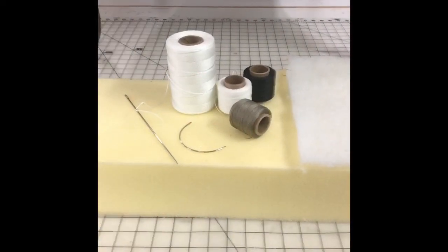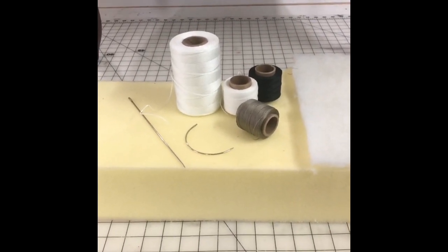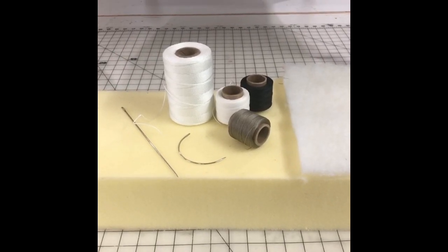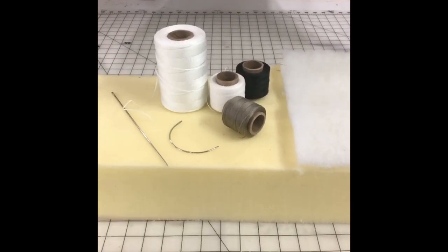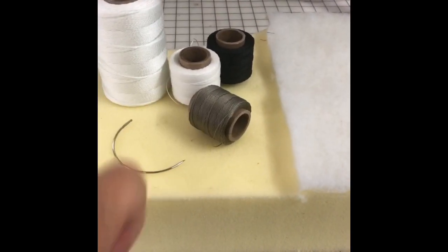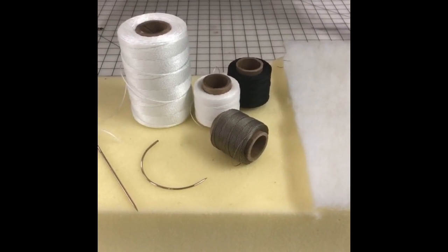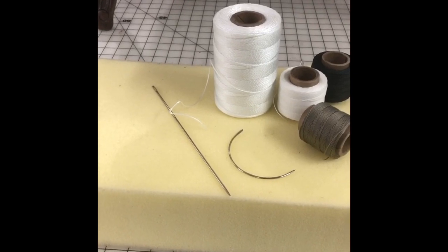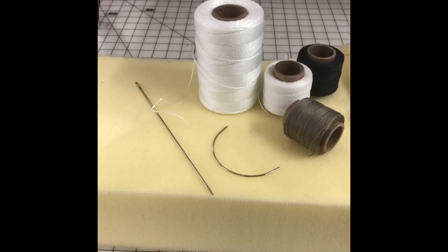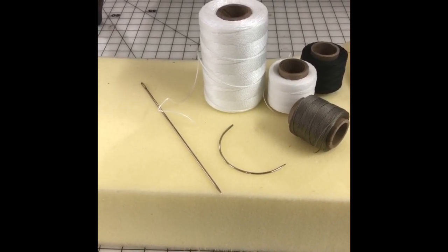Here are the supplies that you need. First, start with a good quality foam — density and thickness depends on what your client prefers, but I typically use a medium density three to four inches depending on the size of the bench, and then I wrap it in Dacron. Next you'll need hand stitching thread and a curved needle to make the decorative stitch along the edge, and then button nylon button tufting twine and a long needle to make either the X style stitch for the tufting detail or to pull your buttons through if you're using buttons.